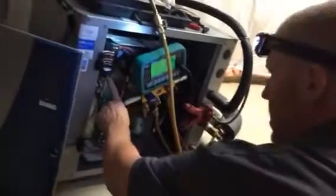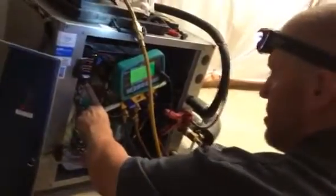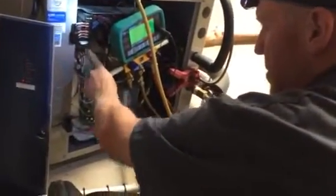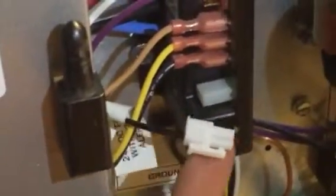Well, in these water furnaces with these comfort alerts, keyword comfort alert is what triggers the solenoid to kick it into high stage, which is via this little teeny plug right here. Well, in order to complete a circuit, the last time I checked, you needed 2 wires, and this is a DC connection. So you can see there's your Molex plug and there is a wire missing out of it. Well, if you dig way back here behind the paper, there is another wire that belongs up inside that Molex plug.